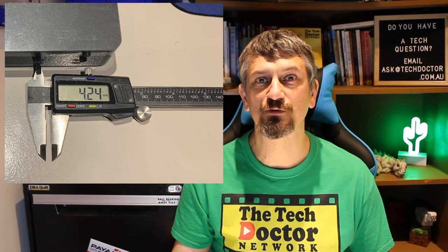This one isn't very helpful — it just says DC 12 volt. Okay, that's one piece of information. The socket itself measures at 4.25 millimetres, and beside it is a little icon which tells you that it is in fact a standard positive tip as well. So now we have three things: voltage, plug, and polarity. Here is the actual plug — it measures at 4 millimetres, and you can see the output is 12 volts at 2 amps with a positive tip. It has a spinning hard drive, so that's not surprising, and we know it's a match.